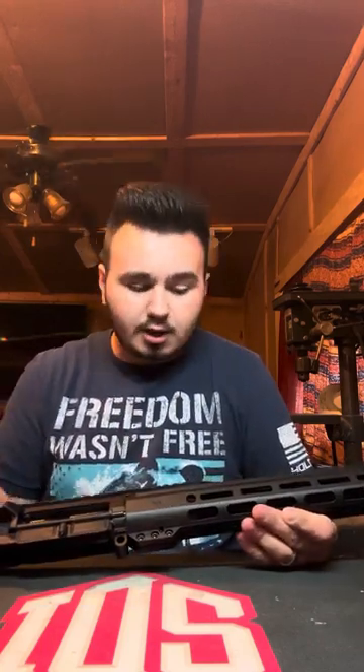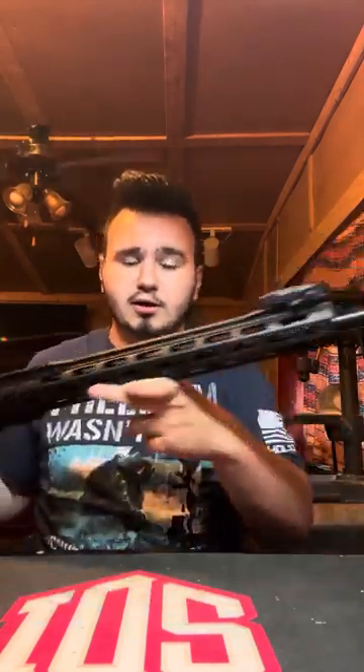So how was the upper receiver build? There really wasn't much to it. I feel like the upper receiver was a lot easier to install than the lower receiver. For torque specs on the barrel, I torqued it at 35 foot-pounds — I think 30 is the minimum, but I went a little higher to 35 just to give that extra foot-pound. Overall, this is a really cool build, and all I've got to do is slap this on the lower and it's technically done.